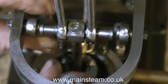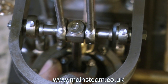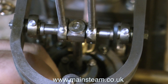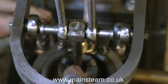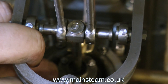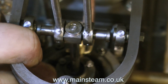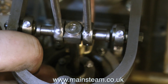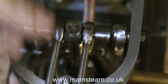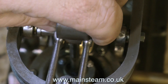The first thing I did was to check the alignment of the machined part of the column, and that's okay — that's where it's supposed to be. At first I thought the column was twisted, but this is an easy fix. What I'm not going to do is bodge it. I'm going to get to the root of the problem and put it right. Just making this whole structure lever to the left is not what I want to do. I'm not going to shim it, I'm not going to machine bits off. There's a simple solution, and I've got a good idea what it is.